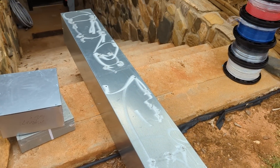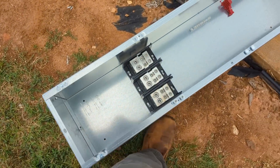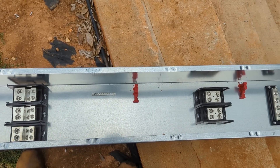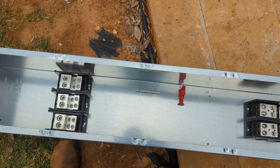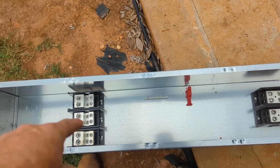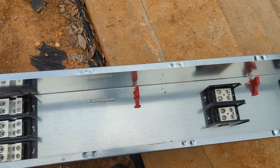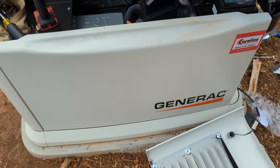We're mounting all this equipment on a superior concrete poured wall. We try to prep these wiring troughs before we hang them on the wall, so we're pre-drilling holes to mount them — whether you use TapCons or nail-ins. TapCons make it removable if you mess up. Add your ground bars, power distribution blocks, wire management, battery combiners — whatever needs to go in here. It's such a pain to do it later.